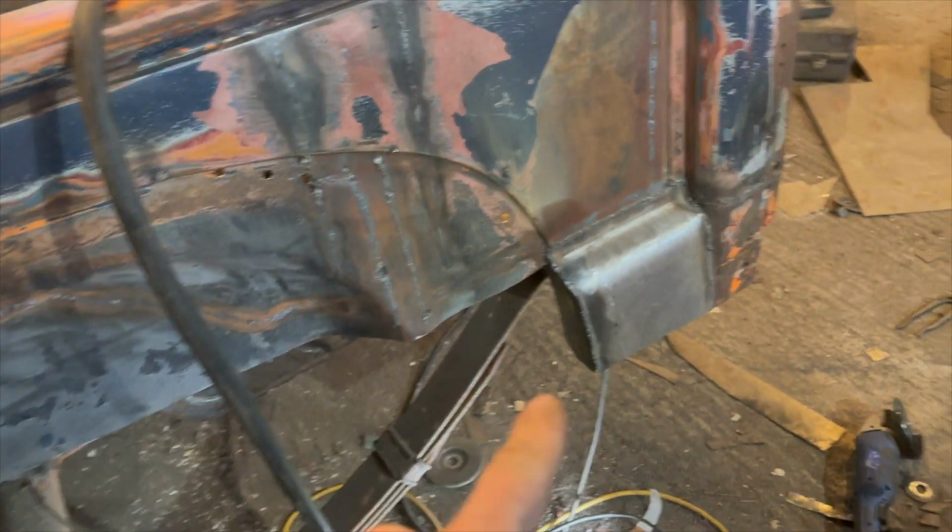All right, there we go. I got these two end caps. They're all done now. So now what we're gonna do, they got little nubs from the weld tacks and all that stuff. I'm just gonna cut them all off there, grind those off. Again, we're not grinding the welds. I'm just grinding off these little weld tacks because they're kind of in the way when you put the fender on. Doesn't line up right, or line up worse than it already does, you know what I mean? So I'm just gonna grind those off the fender itself. Then we're going to mount the fender back, and then we can drill our holes and mount those guys on the end.